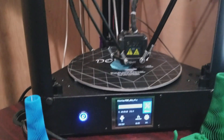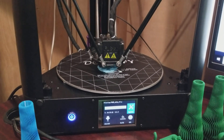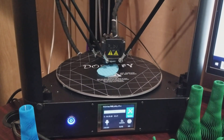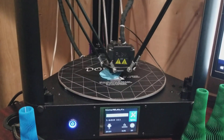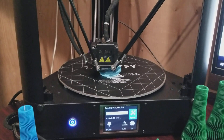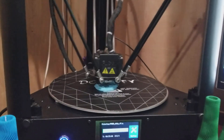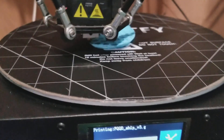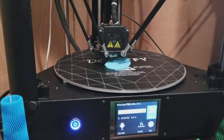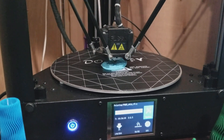A couple of things I wanted to mention: the manual needs some help. They really need to do a better job on the user manual — it's missing some key things. One of them is how to adjust the Z offset. A Delta like this, especially this Delta, has auto-leveling from the factory. Because it has auto-leveling, there are no bed springs; you can't adjust the bed. In this case it actually uses the nozzle as a sensor, and there's a conductive mat that fits underneath the bed sticker. If you needed to re-level this, you have to peel the bed mat off — it touches that conductive surface with the nozzle, determines level, stores it in memory. It's persistent even between reboots, which is pretty impressive.